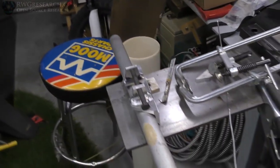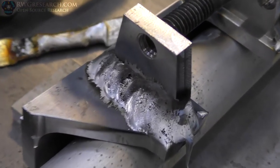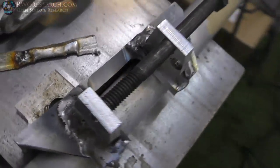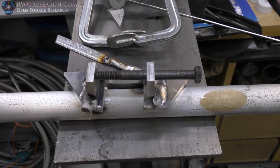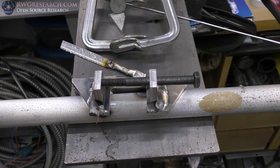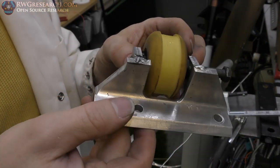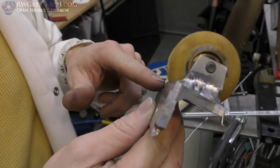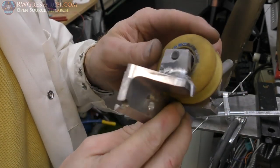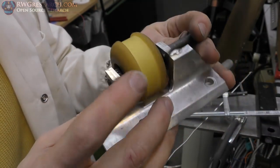Well, I've welded better and I've welded worse — that ain't bad. I used way too much filler on this side, and this side is just about as bad, but you know what, it ain't going anywhere. I let this hang because I'm gonna mill it off — mill it as short as I can. That is not going anywhere. That weld did a lot better than the last time I tried to weld aluminum; I had anodized aluminum and I didn't know it until I was too late. I had to undercut this because there's a weld on the bar that sticks out past the bar, so I had to mill that out. I'll have to come back and touch these two little spots, but I'm happy with that. Now we've got to buff this out and mill these ends off.